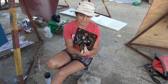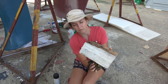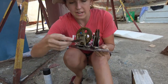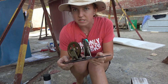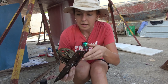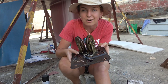This is another piece that we need to repurpose — this is our steering idler. This is what was on the underneath side of the block of wood beneath our cockpit floor, getting rained on, getting seawater. So it was all just rusted out. This thing used to be actually a lot thicker. These flakes literally just fell off of it. I sprayed it with some WD-40 to stop the rust. I cleaned it up as much as I could. We were thinking about buying a whole new part, but it's still pretty solid. It's thinner than it was, and the new part sold by Edson is like a five or six hundred dollar item.